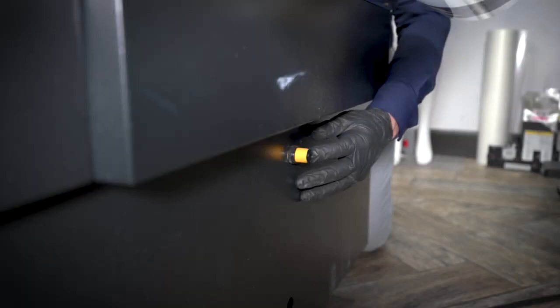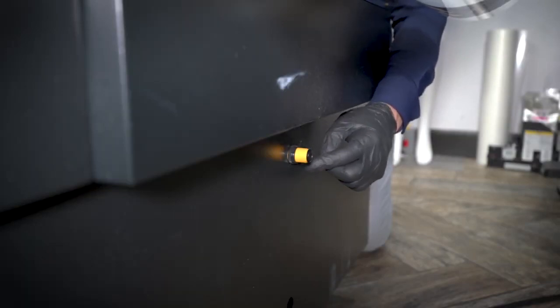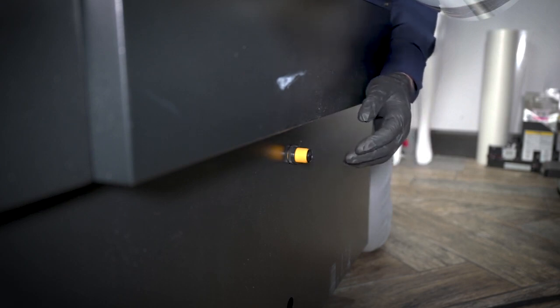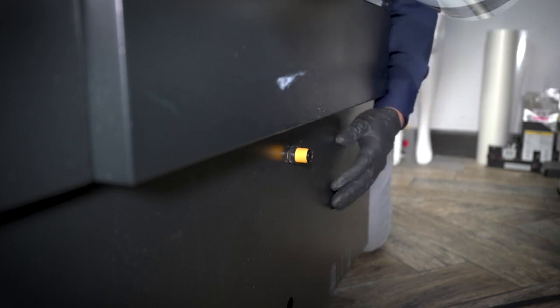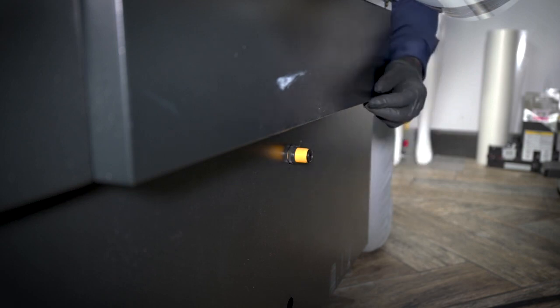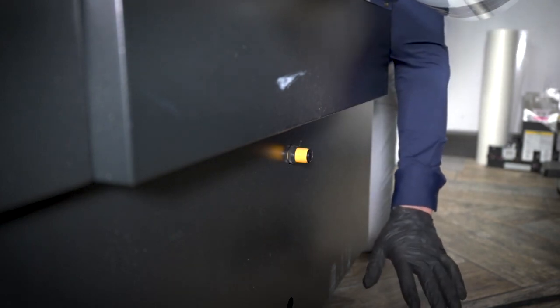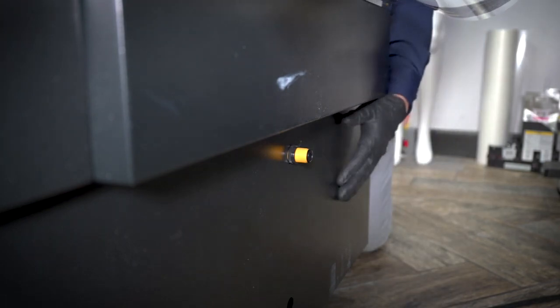This is our media sensor, which locates the printed media as it repels from the printer. It allows the shaker to interface both units, which then begins the process of pulling the media upward and through the system to be powdered, shaken, and gelled to complete the transfer prep process. The shaker locates the media about 10 inches — or 25 centimeters — off the floor to engage the threading cycle. It's a great feature for autonomous printing direct-to-film.